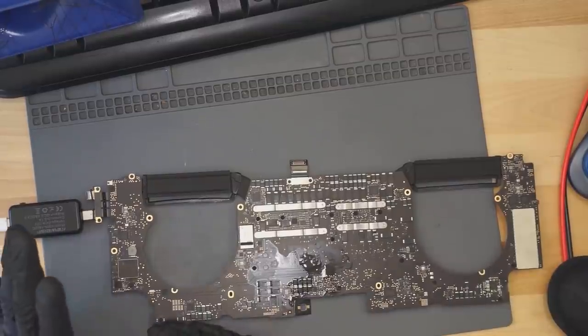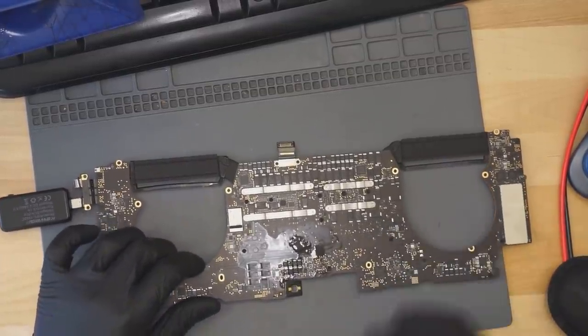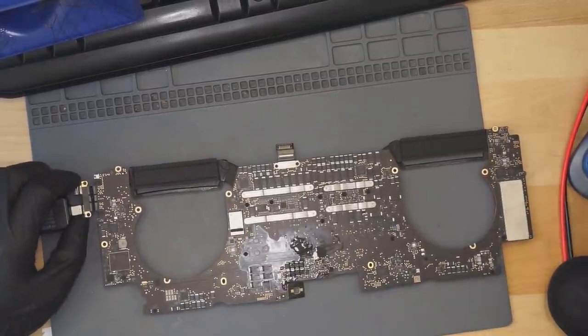Now, for those chips to start working, they need to get their voltage input. And on the older MacBooks, PP3V42_G3Hot was the rail for that circuit that spoke to the charger. On these machines, PP3V3_G3Hot does a lot of the same thing. So let's open up a schematic and a board view and see what's going on there.